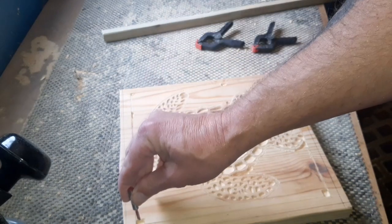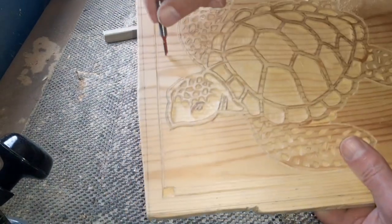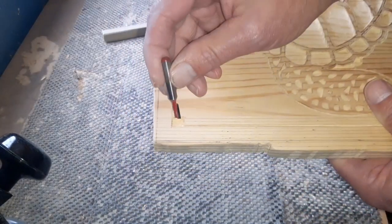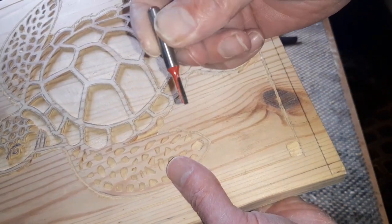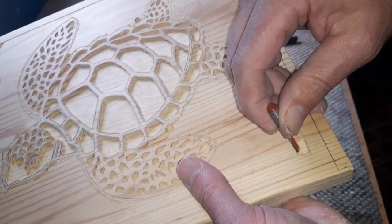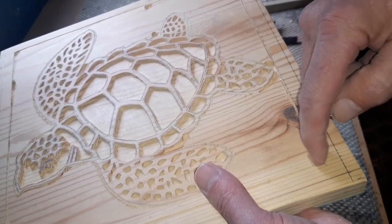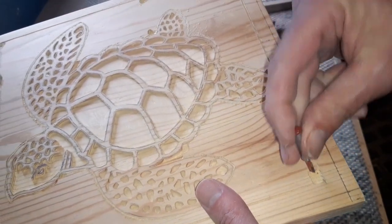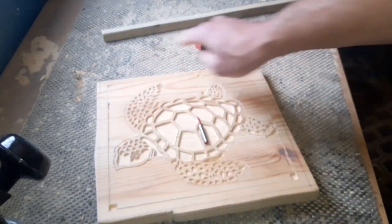And I'll use this just to set it to the same depth, and then basically clear out all the surrounding wood. You notice I've removed each corner, like I say. That's because with this size of bit, as you come in, you're not going to get a square corner. It'll end up being round. So we do that with a CNC bit, and then we just clear the rest out with one of these. Okay, we'll pop that in, and quickly just remove the backer on this.